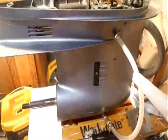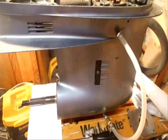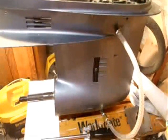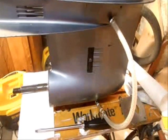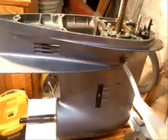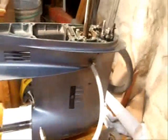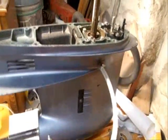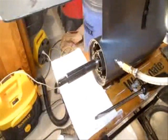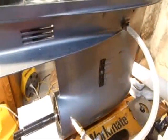What happened was last fall, when I changed the fluid in my lower unit, I got about half a cup of water — it just came out. Clean water, looked like spring water. It had separated from the oil. So I made this little pressure checker, which I just took one of the fill units and put a compressor end on. I put about 10 psi in there, and I saw air leaking from both this top seal right under the water pump. Air was actually hissing out of there, and oil was coming out of the bottom one. The top leak looked worse than the bottom one.